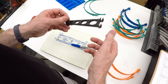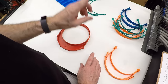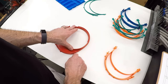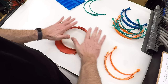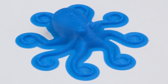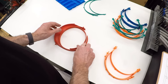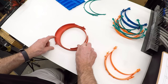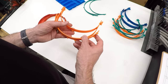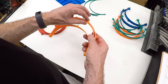Sometimes you can't modify the part because it's not yours — and that's the case here. I didn't have the luxury of permanently modifying the part. One thing I could have done is gone into my slicer and told it to add a brim. You can also do a raft, but most of the time you don't need a raft these days — that's a whole platform it builds up and builds the part on top of. A brim is one layer of plastic: it just expands a little brim around the outside of the part, like a hat brim, giving it more surface area to hold that first layer down. That generally works very well. The problem I find with it, especially on a part like this, is you get all that material and then you have to clean it off.